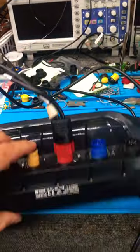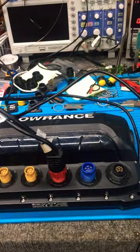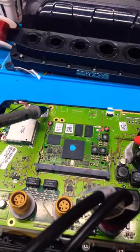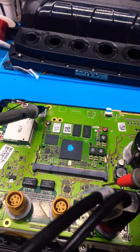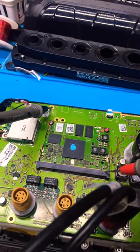So let's finish taking this thing apart. We'll take all the T8 screws out and take a look at the board. We're getting 0 volts on this track here, which should be 5 volts — it's the 5 volt rail going to the processor. That's why it's dead.